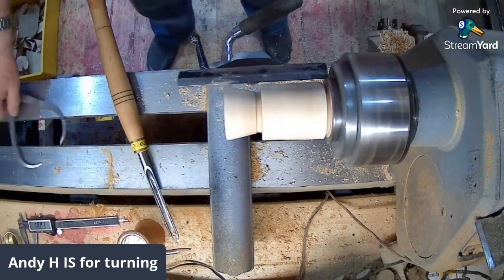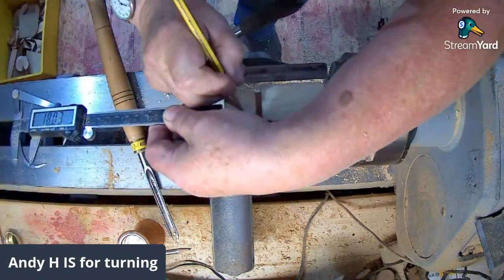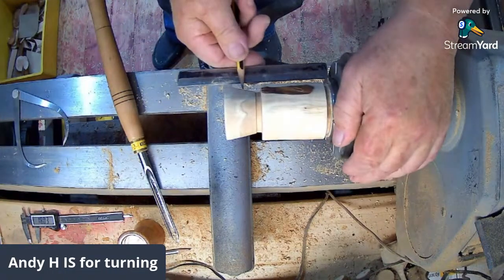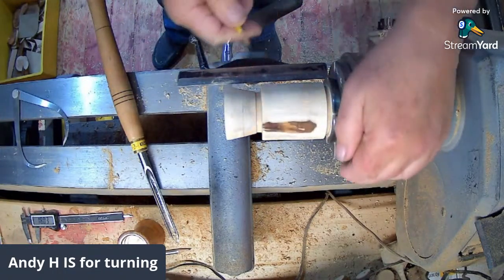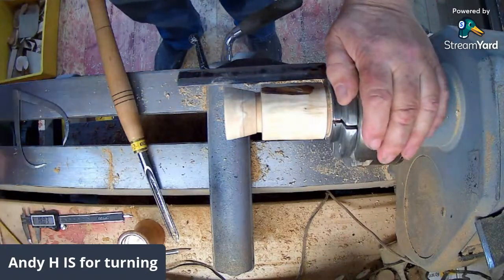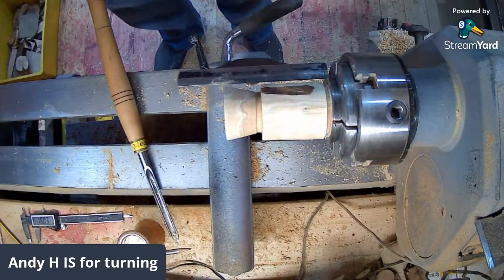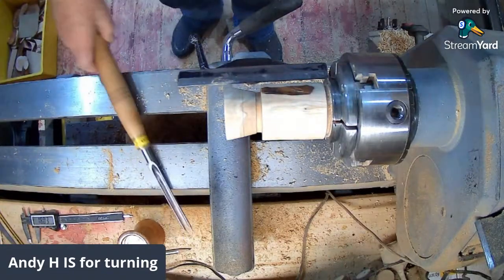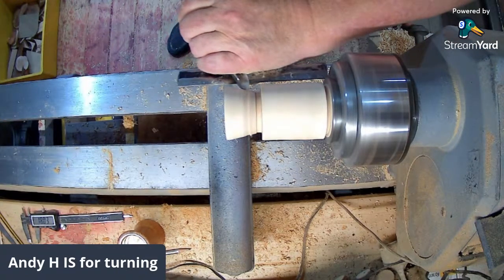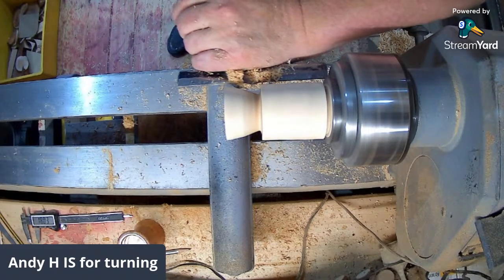No, it's gone. No, Douglas, I would be very reluctant to use a bandsaw to cut anything big, particularly as it's round. You are asking for trouble. Yeah, unless you have a purpose-made sledge. Tiny Turner, she was making some for hers, wasn't she, at one point? Yeah, but I'm still very reluctant to cut anything round that sort of size. Can be very tricky. Price of bandsaw blades at the moment, you don't really want to mess them up.